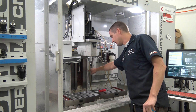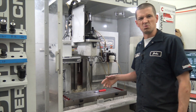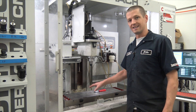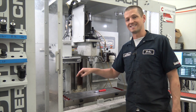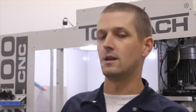We're replacing the way covers — there are only three sets: the bottom of the Z and then the front and back of the Y, mostly cosmetic. Adjusting the gibs is a fun process where I learned a lot trying to understand and accurately measure backlash, as well as messing with the preload especially on the X axis ball screw, and then finally checking the tram. If you're interested in one of those specific things, look in the video description for timestamps — especially on the gibs, we learned a lot about how to do that correctly and not correctly.